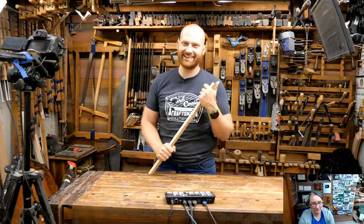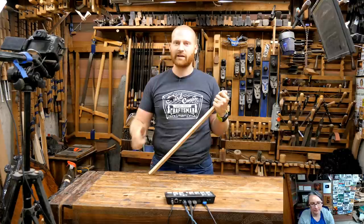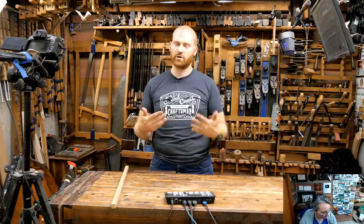So, yeah, that's really the big key is allow air to get around all things. And for most joinery, it's not as much of a problem. But anytime you're going to be doing cross-grain joinery, usually you want to do the joinery and the glue up all in one day in one go. Because if you're in an area where the moisture and temperatures are going to be changing, you may cut the joinery one day, set it down, and then a day later come back together and one board has swollen, and now that tenon won't go into that mortise because it's too big.